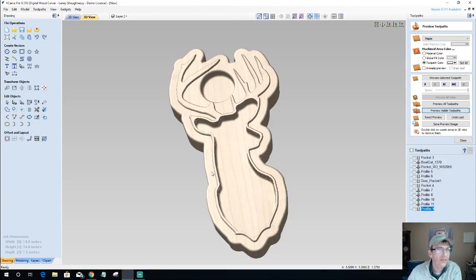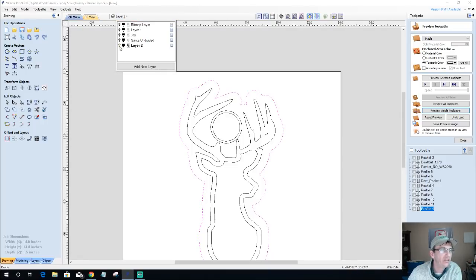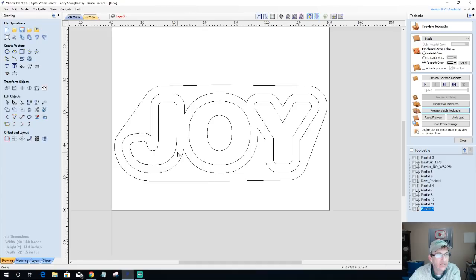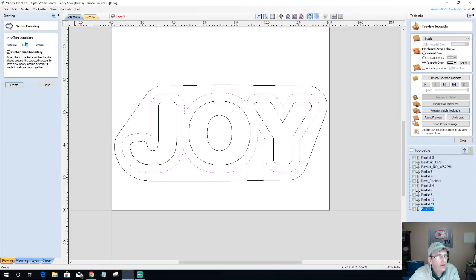Okay. So now the very last one, guys, what you saw at the beginning of the show, was our joy. What I've done here, similar to the deer, is I typed in the word joy. The vectors for the word joy were offset outward a half an inch. These three selected letters were offset outward a half an inch to create this outer profile. From there, this outside profile was selected, and using the boundary create tool, with a rubber band boundary selected for another distance of a half an inch, that creates this rubber band boundary around our entire design. That's how we get this profile.